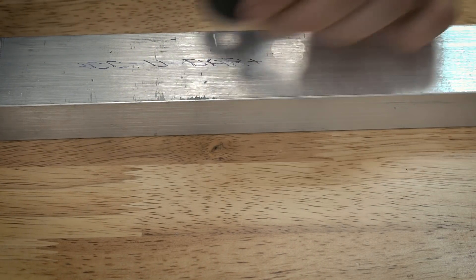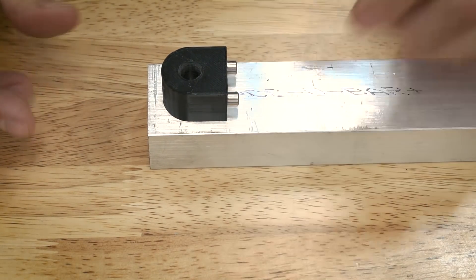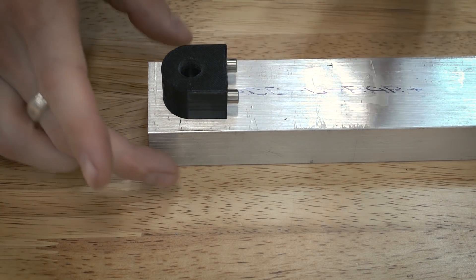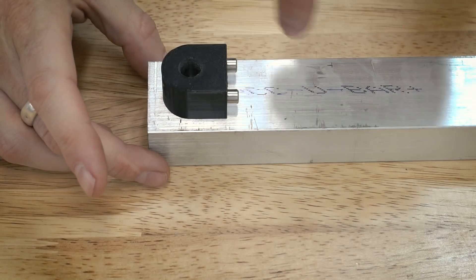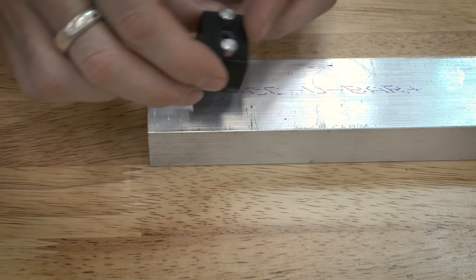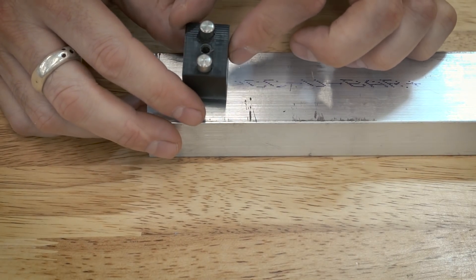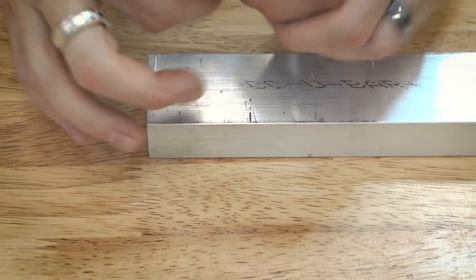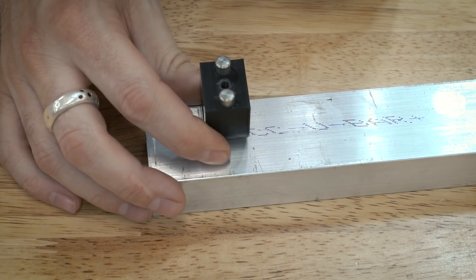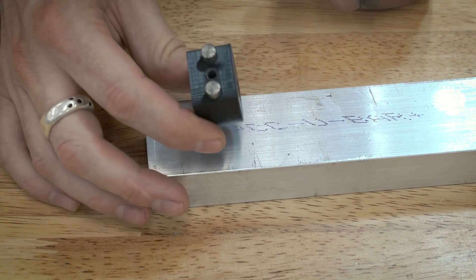The way I'm going to be cutting this out — I'm going to do the contour around the outside, lop off the bar right there, mount this in the vise, do the contour, flip that upside down, shave off the bottom of that, and then flip it up on its side and do the features all around there. So it should be pretty easy. It's going to be one operation like that, another one once you flip it upside down, and then the third one like that — so three total setups or operations. Let's take a very quick look at the CAM and then start cutting this out.